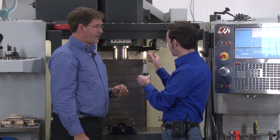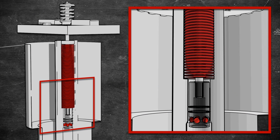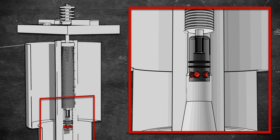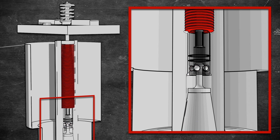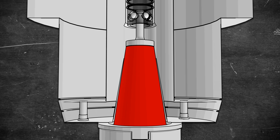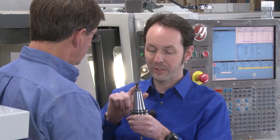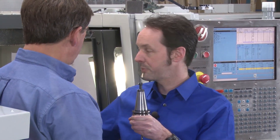When you press the button, there's a big long rod with a bunch of diaphragm springs and a claw. The claw comes down and opens up, and when you release the button it grabs the holder and sucks it up. Spring washers hold it in place very rigidly against the taper. This is a CAT 40 tool holder taper angle — it's a very precision angle and there's math for that. Any CAT 40 tool holder will fit in this machine.